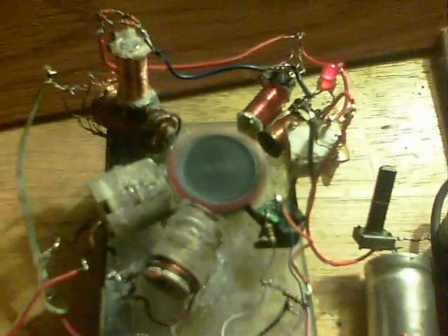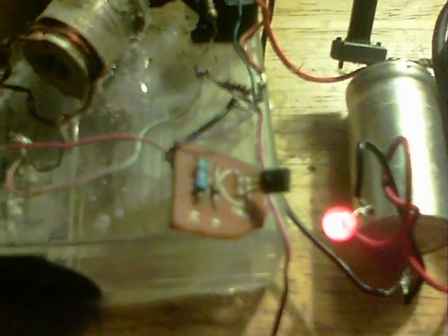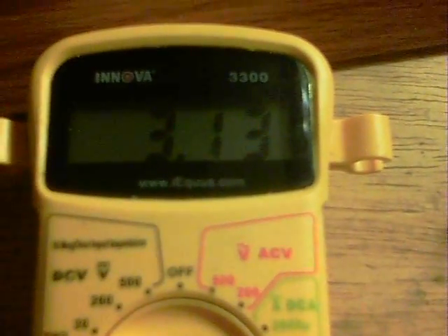Here's the circuit running. I've been experimenting a bit more with it — I've got a 2N2222 on there now on its own little circuit board found on some junk electronics, and it runs the circuit pretty well. The input voltage is 3.13 volts. We've got this little device from before with one connection going to this side of the coil and the other one spare at the moment.